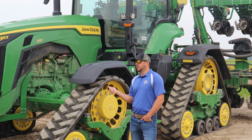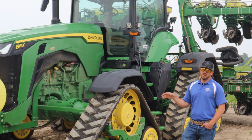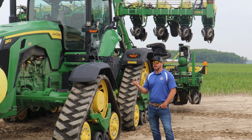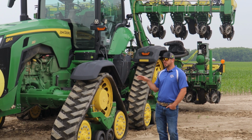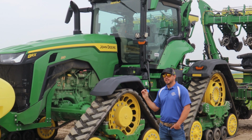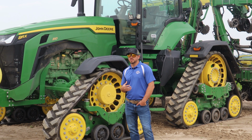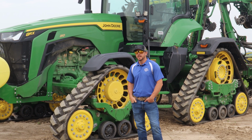One of the big things we were focused on this past year was pinch rows. Pinch rows have always been something we fought a lot with our previous corn planters, with the type of soils that we have, a little more mellow soils. Pinch rows were always an issue with the wheels on the planters. So going to this stack fold planter, which was mounted on these RX tractors, distributed the weight across the tracks a lot better than what our previous planters did. So our pinch row reduction was really, really good. I was actually surprised with how well that did this year.